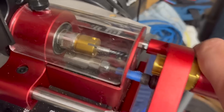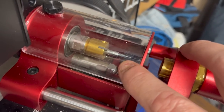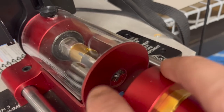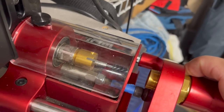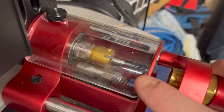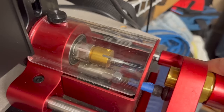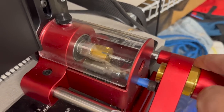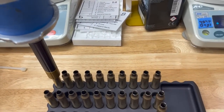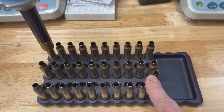This is just a quick test, but since I was playing around I thought I'd show everybody what I did. I took the pilot out of my Henderson and modified a simple nylon brush — you can just see the end of it right there — to fit in there. It really doesn't affect the operation since I'm expanding over the size of the pilot anyway. The brush now, when it's turning, is cleaning out the inside of the neck while still trimming and chamfering exactly the same. I have 10 rounds run through the Henderson with the brush and then 10 run through the normal way with just the pilot.